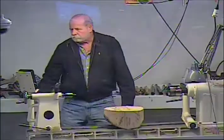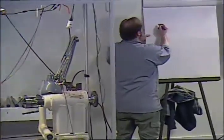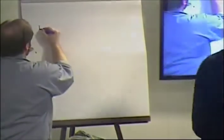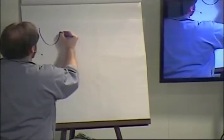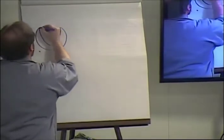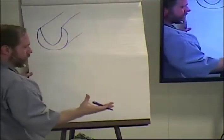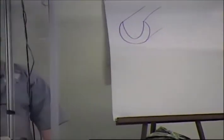Okay. The elliptical bowl gouge, which is the preferred bowl gouge for the 40-40 grind, is going to have a continuous curve on the inside of the bowl gouge. Something like that. Okay. The V-shaped bowl gouge, which is Thompson Tools. Does Thompson Tools make an elliptical? Parabolic. Parabolic, yeah.